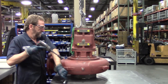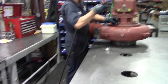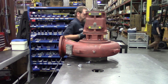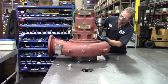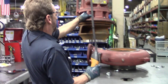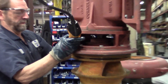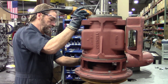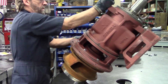So this is a six NNT cutter pump. Kenny's taking the pump out of the volute right now. Then we're going to take the impeller lock screw out, take the impeller off, and then show you how to properly replace the seal and reinstall the impeller. Something like this, probably from start to finish, about two hours to build the whole thing. Replacing the seal doesn't take too long — usually the longest part is getting the impeller off, depending on how long the pump's been ran and what it's been ran in.